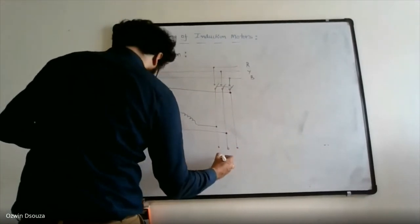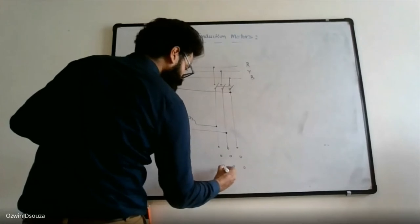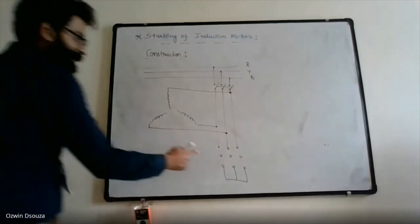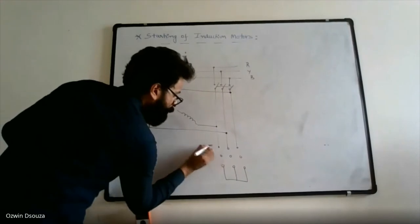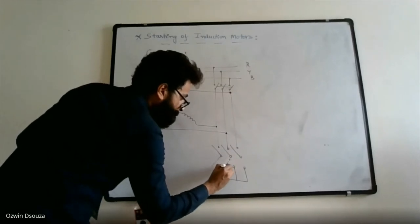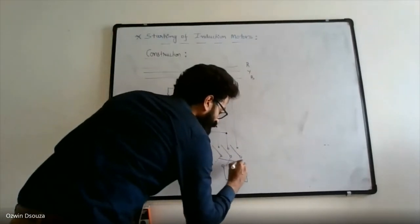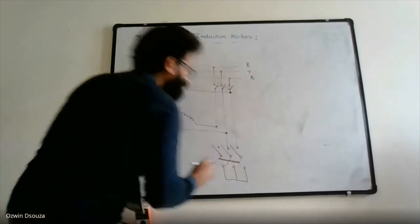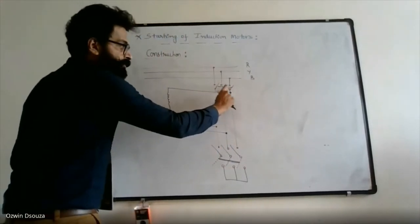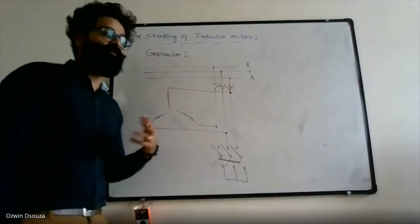So in the bottom half, you will have a second switch, TPDT switch, triple pole, double throw, which will establish the desired star delta connection. This particular switch can be operated in the upward direction as well as in the downward direction. This straight line which connects first contact to third contact simply says that all the three contacts are moving in unison. Okay, so they move together.